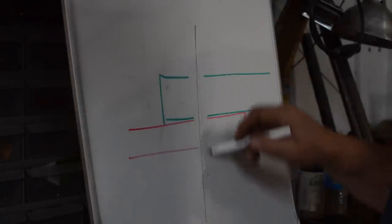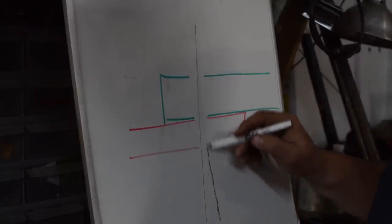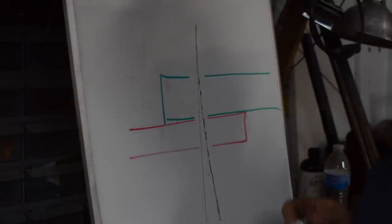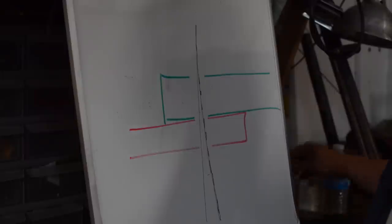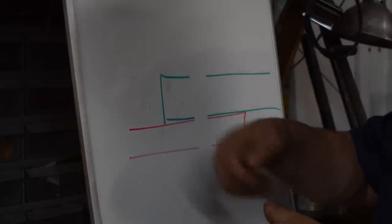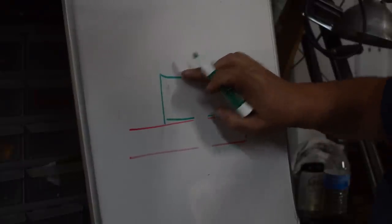And some guy would come in with a big thing called a spud wrench, and he would stick this wrench through it and line the holes up and then pull the spud out. And when he pulled the spud out, you'd wind up with two holes that were lined up. And then the guy would be over there with the furnace, getting this rivet hot.